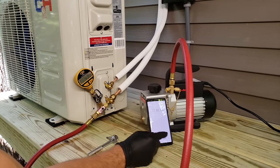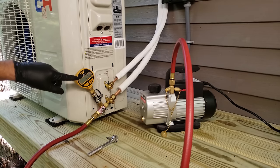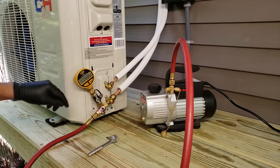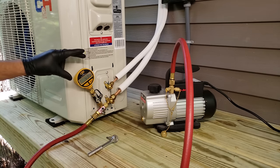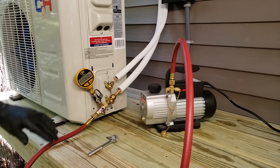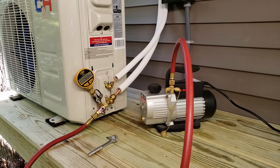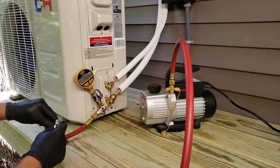Now let's get back to this installation. There's our 10-minute standing vacuum test result. We see that the vacuum level rose to 430, but it did not continue to just keep rising. Also, when the vacuum gauge shuts off and you turn it back on, it always tends to read about 20 microns higher, but it's always been pretty accurate. So 430 microns — we know that there's no air, no nitrogen, no leaks, no water in that system. We're good to go and can go ahead and release the refrigerant from this system into the lines.